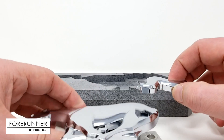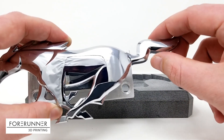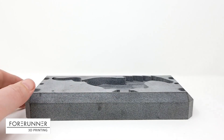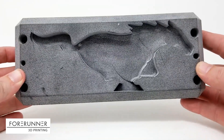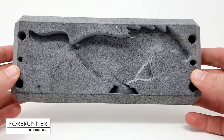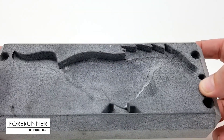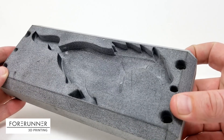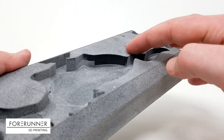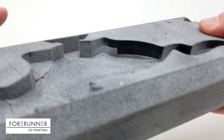Now I'll show you why I'm specifically interested in those bottom areas along this side of the pony. This is the nest after 10,000 cycles of being in alignment and then another 20,000-plus cycles with a bad misalignment. Looking at it right now it doesn't look too terribly worse for wear, until you spin it around this way — and you can literally see the areas where we wore rubber off of the part.